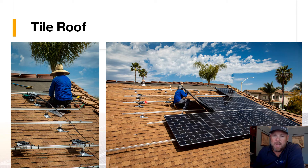If we do the tile job the other way — clearing the full area — we come all the way down to the laminate, taking the tiles off and stacking them aside. We run down the trusses with our footers, and once the project is done we put the tile underneath the solar panels and surround the cleared area. This is more labor-intensive, but some jobs necessitate it, and we'll bring our roofing specialists in to help take those tiles off and put them back on.